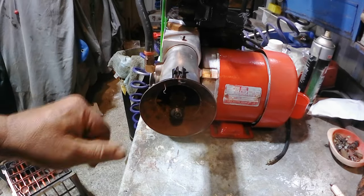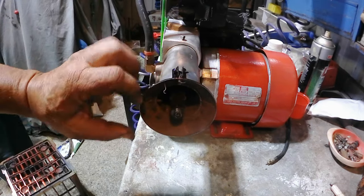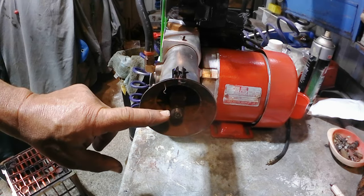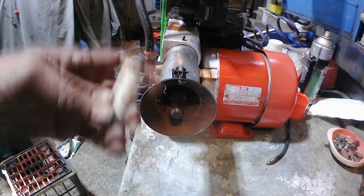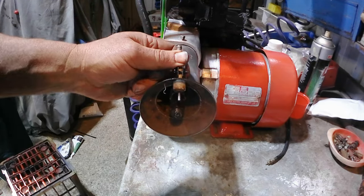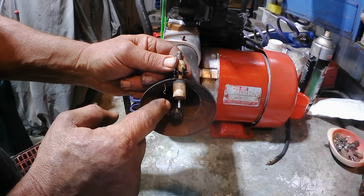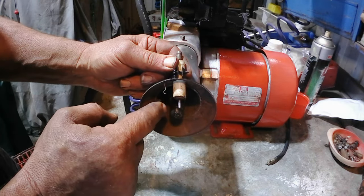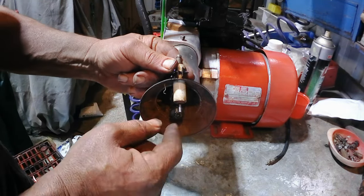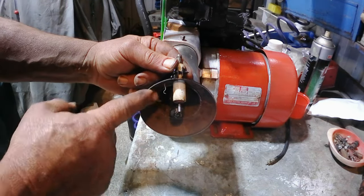So our next little challenge is this is the nozzle where the fuel is sprayed out, and then there should be a metal electrode that goes from here to the igniter. So this little china insulator holds the igniter. And this electrode should reach out to about here, so the spark jumps across there to ignite the fuel. And that's not going to do that, because this is rusted off. So we need to make a new one of these.